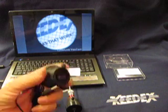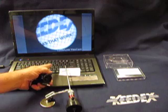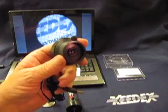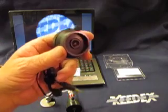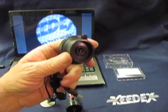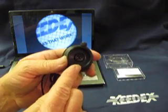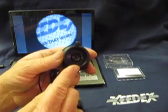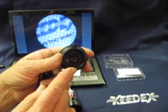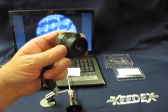The viewer comes pre-adjusted from the factory with a focal point of 3/8 of an inch out to an inch and a half. If you're looking at something closer than 3/8 of an inch or further than an inch and a half, you might need to adjust the focus. To adjust the focus is very simple. If you're working within 3/8 of an inch, simply turn the lens counter-clockwise — typically one quarter to one half of a turn is all that's necessary. If you're looking at something further than an inch and a half, just turn it clockwise. Again, typically one quarter to one half of a turn is all that's needed to put the unit into focus.